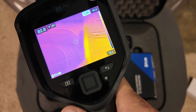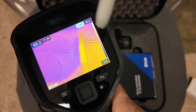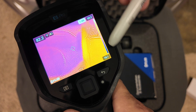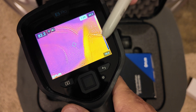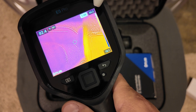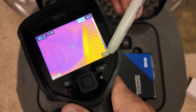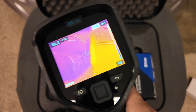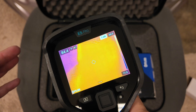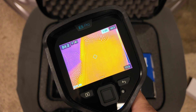On the right side of the camera, this shows the highest temperature it sees and the lowest temperature it sees, with a color gradient to explain the range. The highest temperature is shown in a lighter, orangish color, and the lowest temperature is shown in purple or dark color. That helps you understand what's the hottest and coldest point on the screen at any given time.